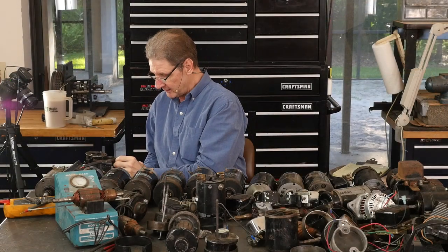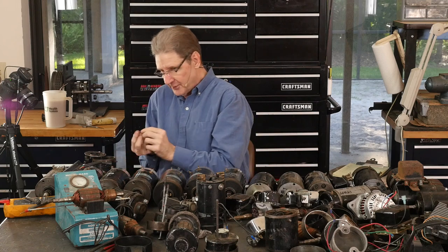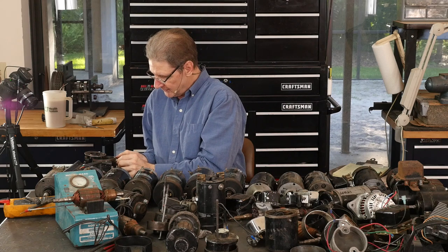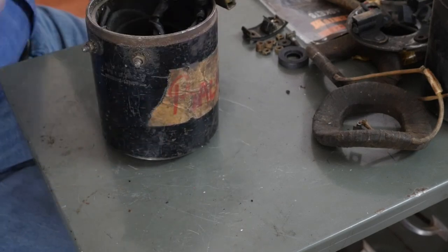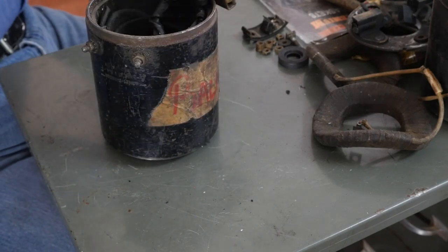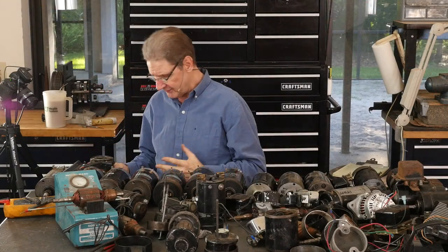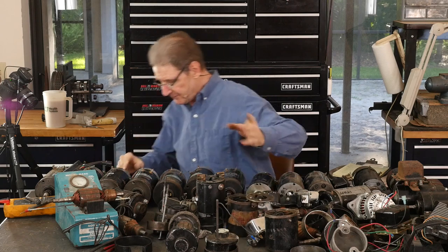You don't even have to take the generator off the bike. You loosen this nut. You take the wire connection nut off. Remove that nut. And you can just, maybe with needle nose, rotate it back, and then gently holding it with the needle nose so you don't scar it up, hopefully you can get the tightening nut, the base nut here, let me show you, get this nut down enough so that you've got a little air gap on that corner, and it will actually start working again. It's like magic. Doesn't happen often. I think there's a plastic version of that spacer, but paper might actually be better because plastic creeps under stress.